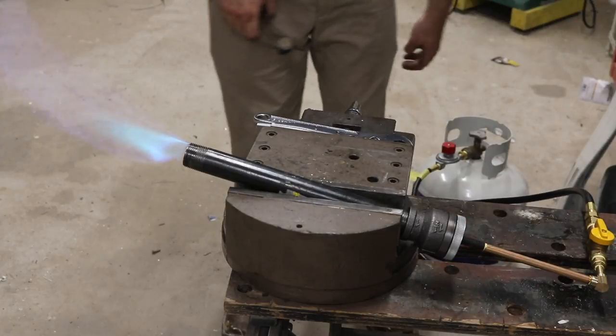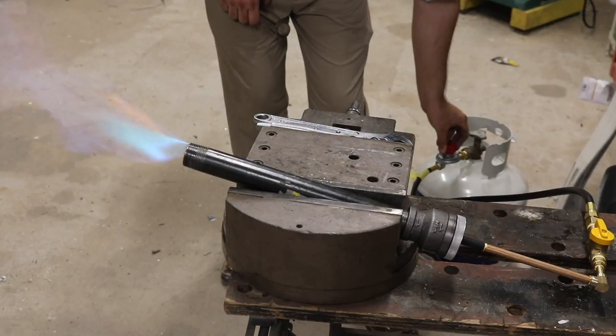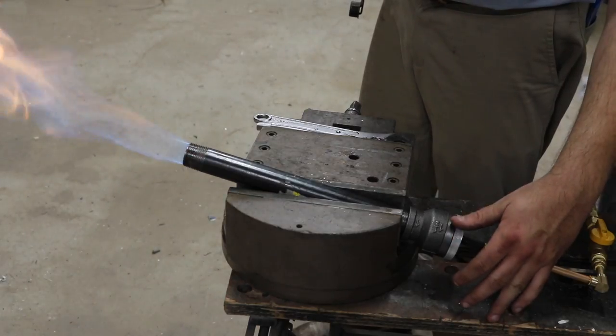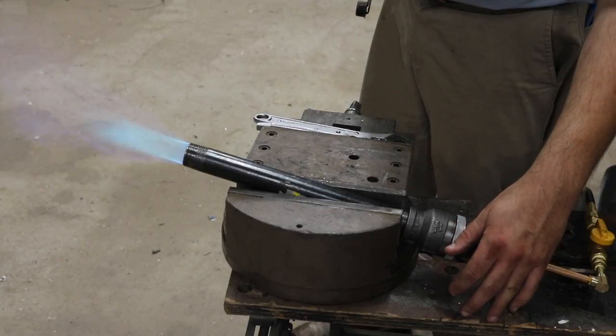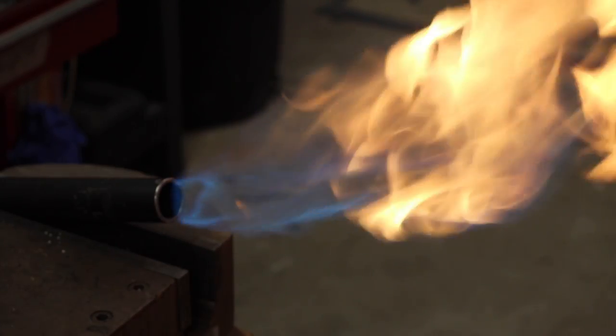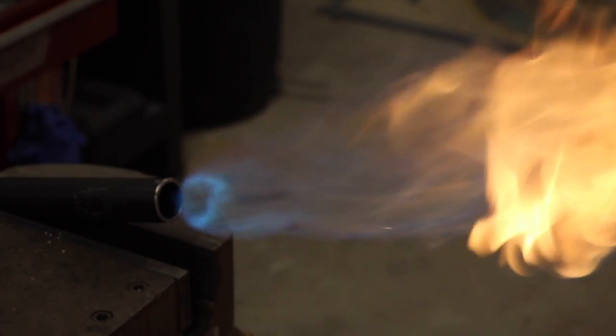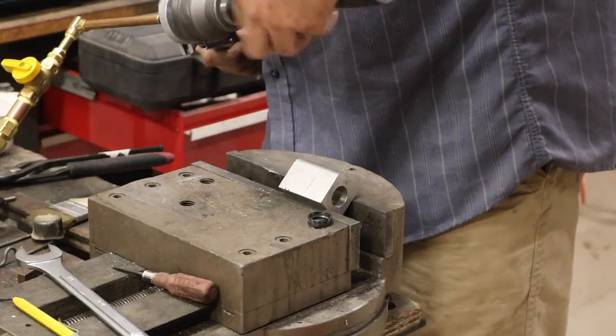The flame it puts out is quite powerful but it's not incredibly stable, and a lot of that is balancing the flow from the regulator as well as the airflow. I noticed a lot of other similar designs use a much shorter tube, so I ended up shortening that one inch piece of black pipe, and that seemed to help a little bit.